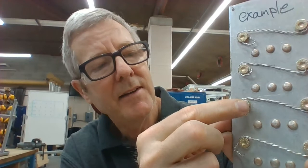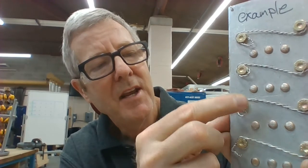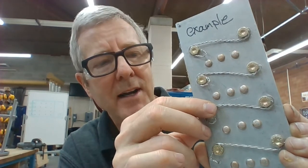These two bolts are wired together — they're called locking bolts. They're wired together so that as they try to loosen up from the shaking of an airplane during takeoff, landing, or other forces on an airplane, they're not going to loosen because they have the safety wire. The safety wire can be cut and then you can take the bolts off.